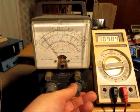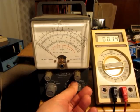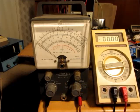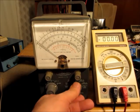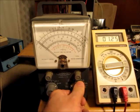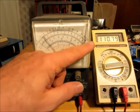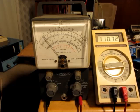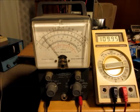Let's go a little higher and see what happens. As you go up in scale, it puts smaller and smaller amounts of current into the device. So to measure one ohm full scale, you're putting 110 milliamps into the circuit. So this one will blow the tube's filament.